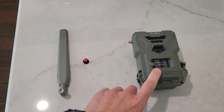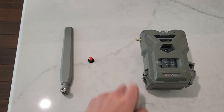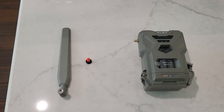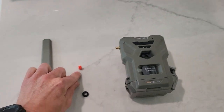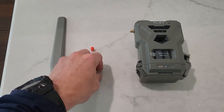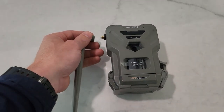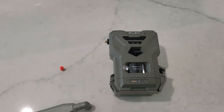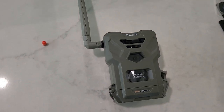I just received my flex, took it out of the package, and had my first watch-out — something you need to be careful about. I took the flex out of the package and the antenna cover and this little protector came off of the connector. You might think that's completely normal, but what I found is that this is two pieces: the protector as well as a seal. This grommet needs to go over the connector to make sure we get a nice tight seal so we don't get moisture down into the flex.